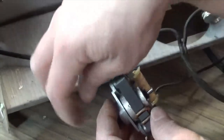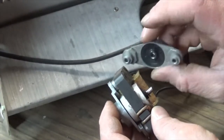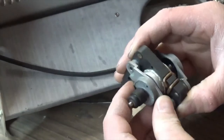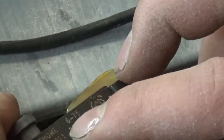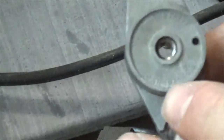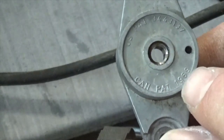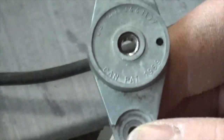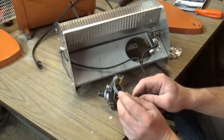Make sure you always keep your rotor in the stator. You're going to have a bunch of different size tiny little spacers on each end of the rotor - make sure you don't lose them and don't swap them around, because usually these spacers are specifically spaced so that when the assembly is all together, the rotor is riding evenly inside the stator. Your rotor's got to be perfectly centered, or at least very close to it. On the motor it says 6-75, and on the bearing there's another year - 1969 - that's the patent year, so that's not exactly the year of the unit.